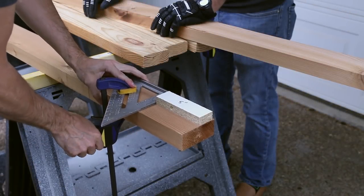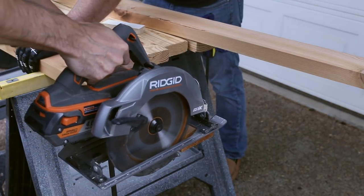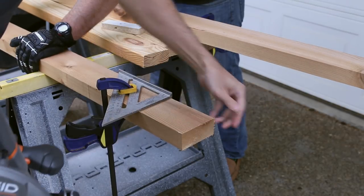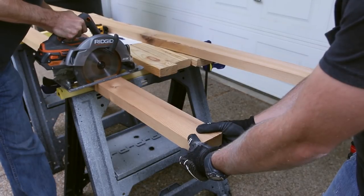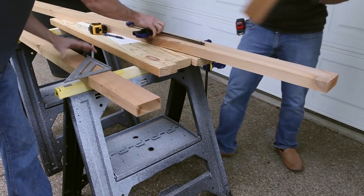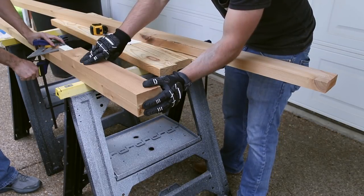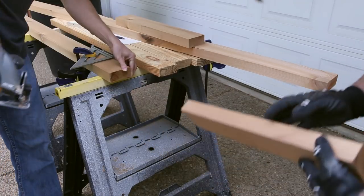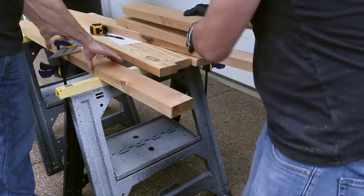While the caulk was drying we went back outside to cut the parts for the base. I'm using cedar 2x4s from a local building supply store, and you don't need a miter saw to get decent cross cuts on these boards. Just clamp a carpenter square to your board and use it to guide you for that 90-degree cut. Each base is made from just 11 boards in three different sizes, all coming out of two 2x4s. After cutting the first of each size, I laid that board back on top of the remaining 2x4, butted it up against the end, and used a spacer to set where my carpenter square needed to go — the spacer being the width between the outside edge of the circular saw and the outside edge of the blade.